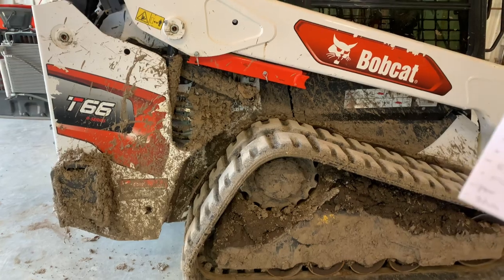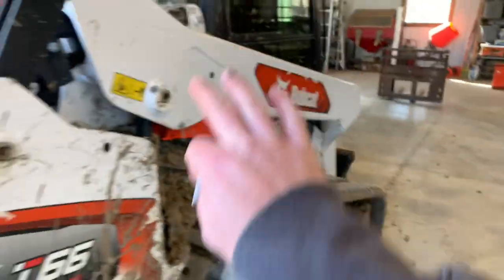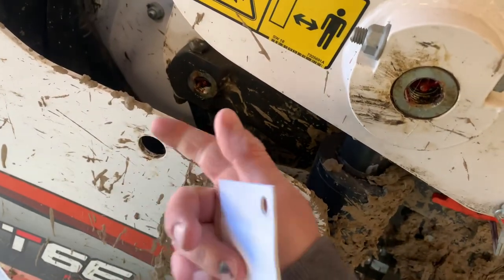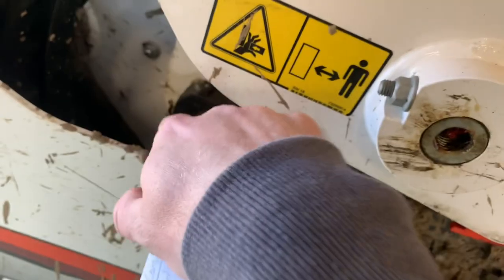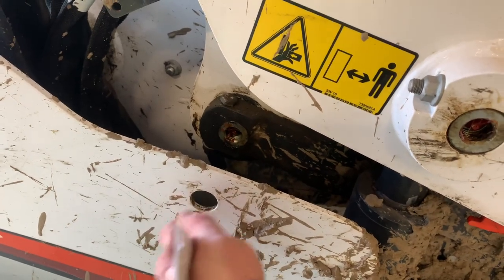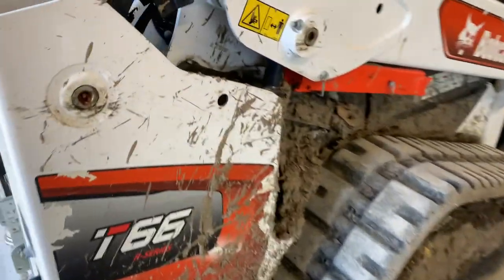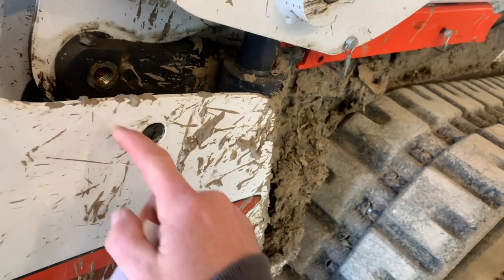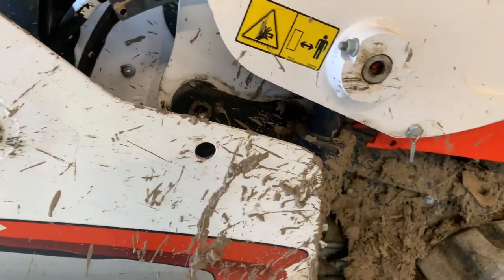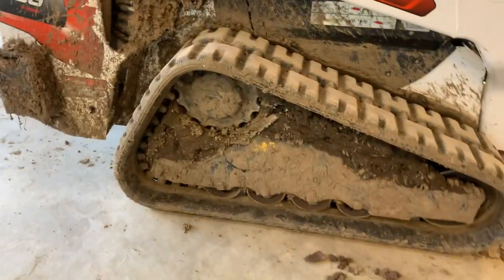There are four grease fittings on this thing that I hate. Most of them are accessible and easy — you can go through quickly with the Milwaukee grease gun, stick it in, pull the trigger. But there's one where you have to come through a hole in the arm from a certain angle, and when you're done you can't pull the grease gun off straight — you'd normally kick it to the side, but that hole traps it. I've actually broken one of my Milwaukee grease gun couplers pulling on that fitting when I got frustrated with it.